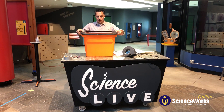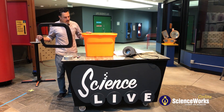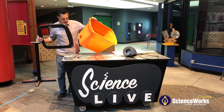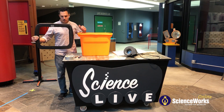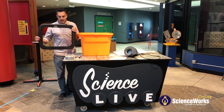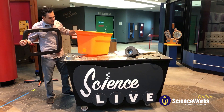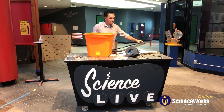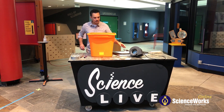I was able to find this at a local store for about six bucks — it's an 18-gallon size plastic tote. What I've done is cut a hole in the lid where we're going to mount the filter and where the air will pass through the top. Then I cut a hole for an intake that matches up with the exhaust portion of the duct fan.